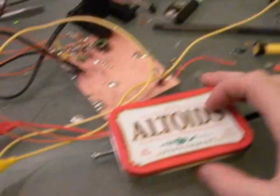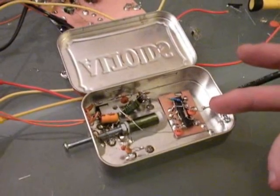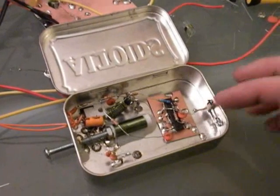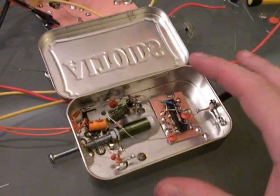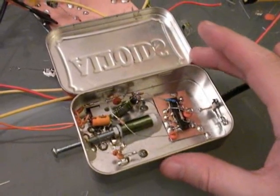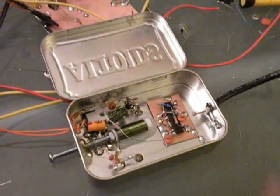I'll see if I can build an amplifier for it, and it would be nice if we can eventually rig this so that we can make a QSO with it. Also keep in mind that the output of this is square waves, which is great for lots of the modern styles of mixers — I think of the Gilbert cell mixer and the SA612 chip that a lot of my designs have been using for the receive side. These square waves should be able to power the receiver pretty well, so hopefully with one nicely designed oscillator I'll be able to have a transmitter and a receiver. And I can always build an amplifier later.